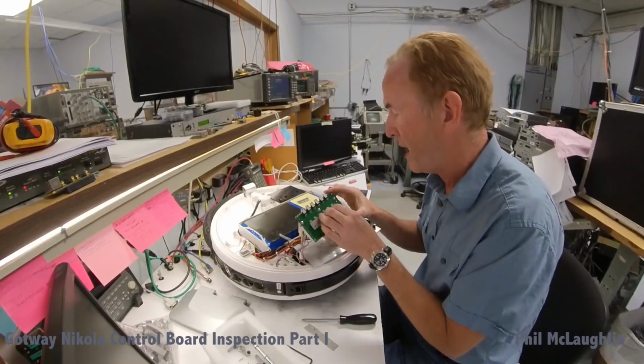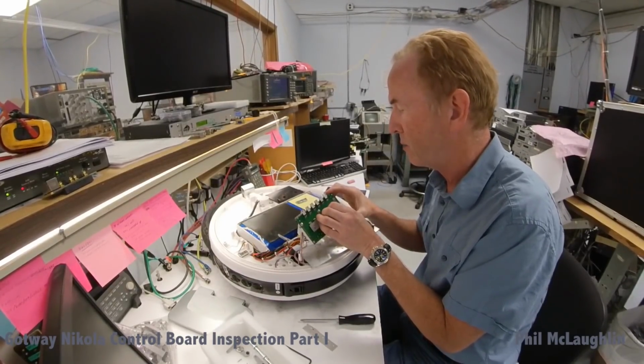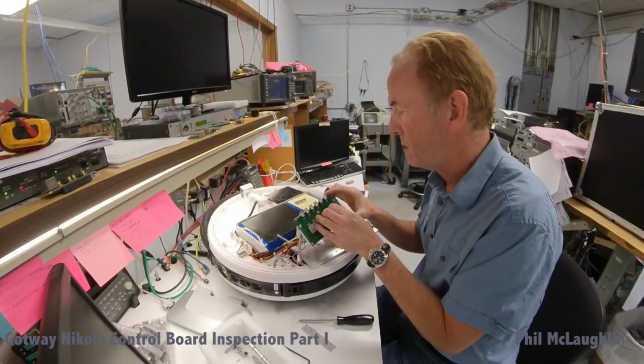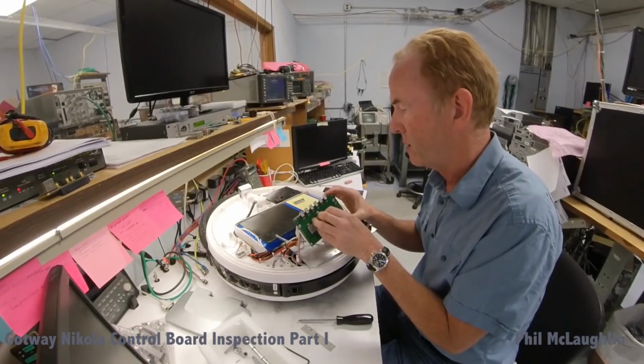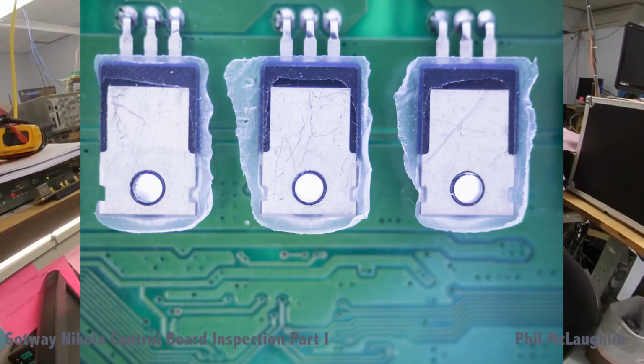The contaminant creates just as much problem if it's on the aluminum surface as if it's directly on the pad. However, it may be okay in this case because it's more toward the center here, and I'm not sure it actually hits the pad. But let's take a look to see what's underneath the pad just to get an idea, because this is where the problem had shown up in other boards. Oh boy. No, this is not good. This is not good.